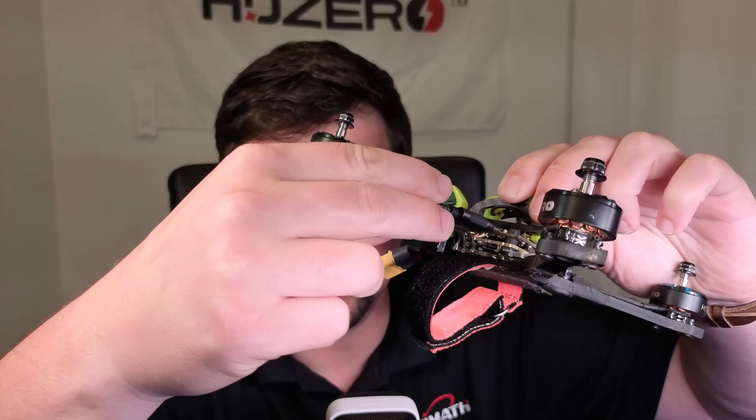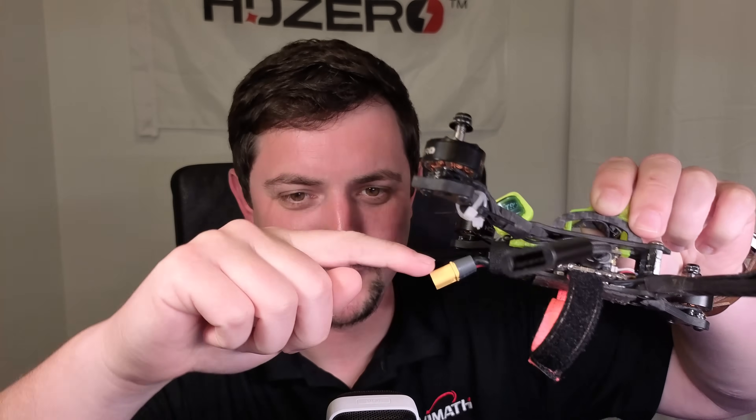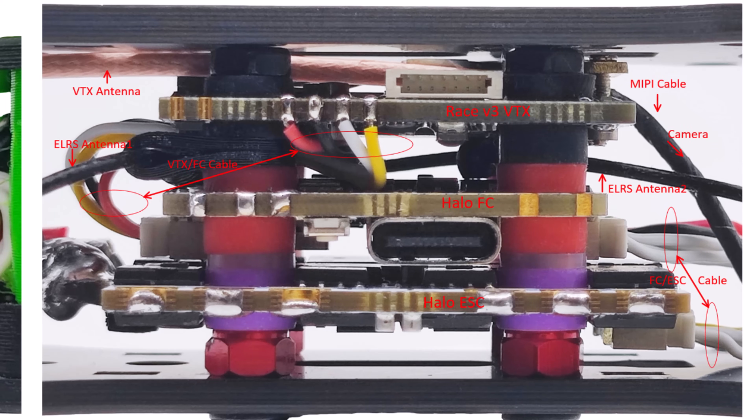Here's a pro tip: when working in Betaflight configurator with a battery plugged in, don't try to fiddle around and short things out. What you want to do with the USB-C connector is — before you plug in the battery, plug in the USB-C, then disconnect the USB-C on the other end to the PC, power up with the main power, and then plug the other end of the USB cable into your computer. You shouldn't be putting something metallic that can short out on things while you have high-voltage powered up. Here are a couple other recommended mounting configurations depending on how your build is set up.